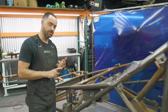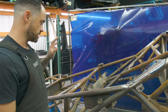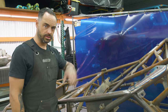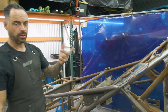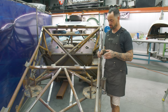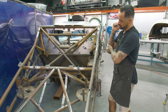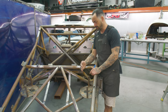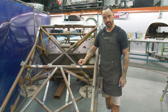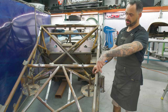The other request was to put in coolers — an engine oil cooler and a rear diff cooler. Not a lot of people run rear diff coolers anymore, but this thing goes in the sand a lot, the rear diff does get hot, and it is a truggy with a live axle. We'll have a rear diff cooler with a mix of soft line and hard line going to the rear axle, plus an oil cooler up front. We also cleaned up some miscellaneous holes and tabs, replaced worn spare tire hold-down tabs with Armada machined eyelets for tie-downs or Y-straps, and cleaned up the rear portion of the bumper.